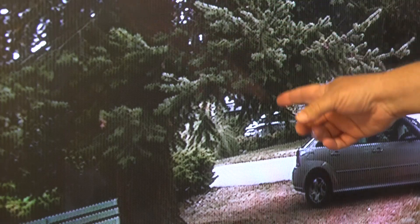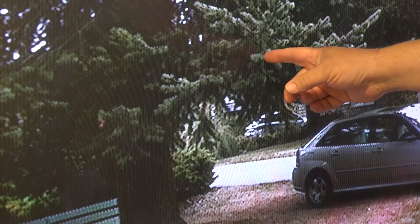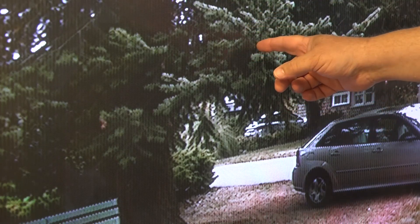I'm going to try and explain the phenomenon of the lines you see here — the dark lines — but you don't see them in areas where it's white. This is a single tube camera being used to display this picture, and where there's color, you're only seeing the color passing through the color filter that delivers those colors. In other areas, the colors aren't making it through the color filter, so they're black.